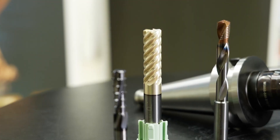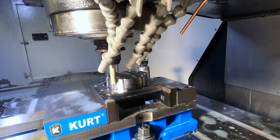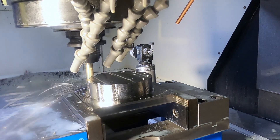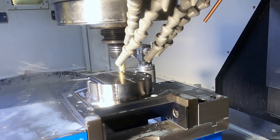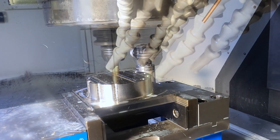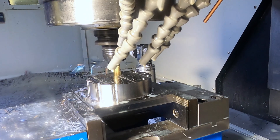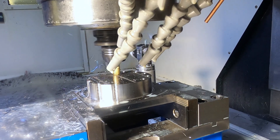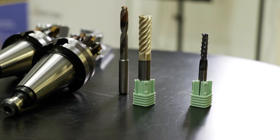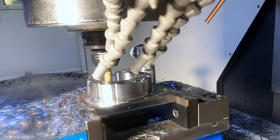We've also got the MD 128 multi-flute cutter here. The theme on this type of cutter is long edge finishing, but now with the high dynamic approach to milling — using CAM software — this is how we machined the centre portion: taking all the material out with a high dynamic tool path. You have a small diameter cutter with lots of teeth, high speed, low depth of cut, with a high feed appropriate for chip thickness.